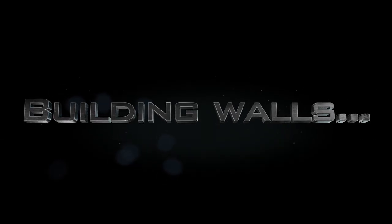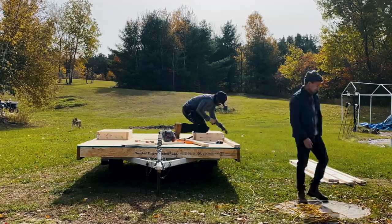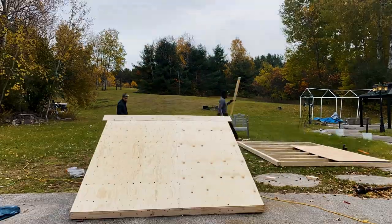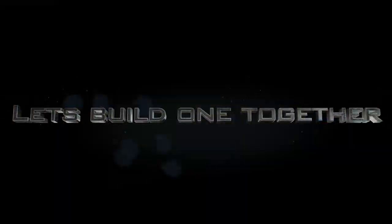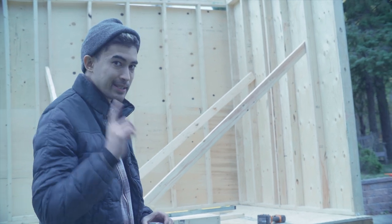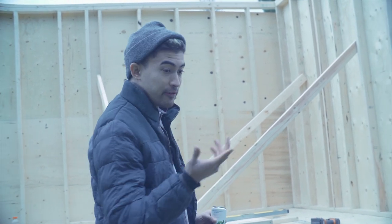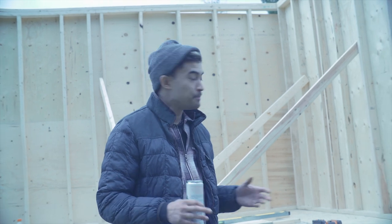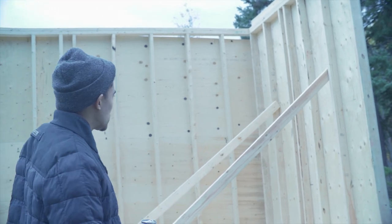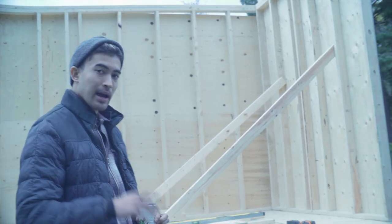This part's kinda boring, so let's go quick through it. I'm actually building this wall right now, so I want to take you a little bit down this journey with me so that we can know exactly what I'm thinking. When you are making your own food truck, or your own whatever, you can follow along and build your own wall. Right now we're going for 8 feet tall, but we need to cut a half inch off each stud so that we can have a slope on the roof — we don't want the water to pool on the roof. So what we're doing is actually marking each stud half inch less.